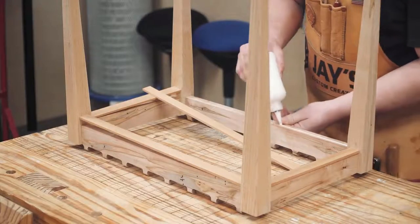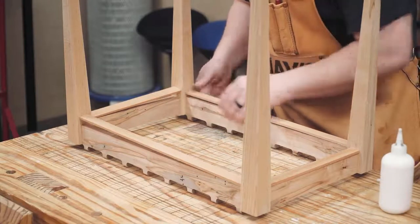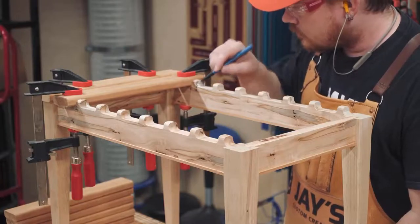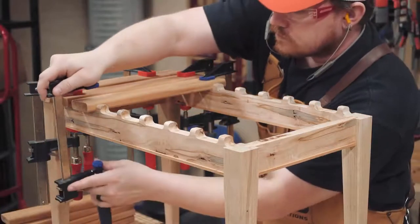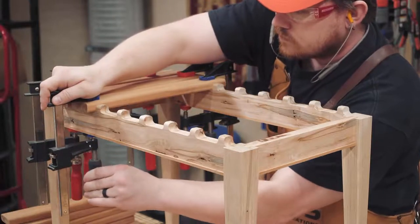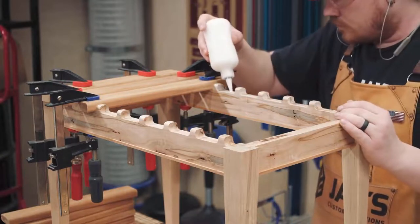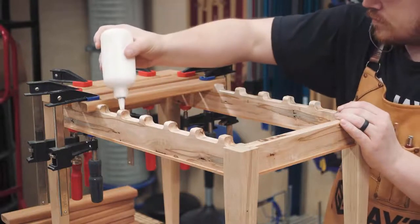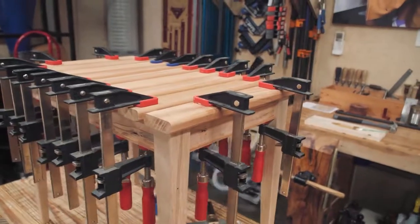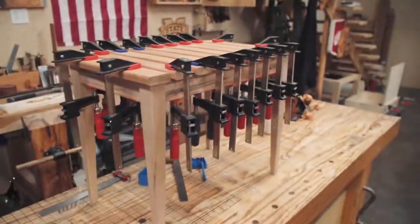The glue for the rest of the project is a quick-setting glue that dries clear. To reduce squeeze-out on the outside I'm only applying a small bead of glue close to the inside edge. The slats are then installed using the same technique — just a little glue near the inside edge. This is a long-grain-to-long-grain glue connection so it should be plenty strong. In my initial SketchUp design I planned on using screws to attach the slats but decided against it mainly for looks — I think it'll look a lot cleaner and I don't think screws are needed for strength. If the glue-only strategy doesn't work out long term, I can always drill and add screws later.